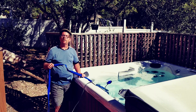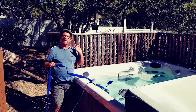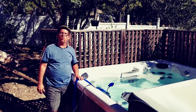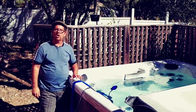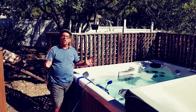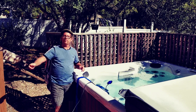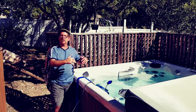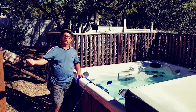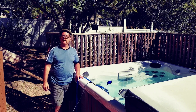Right now it's about 11 a.m., and if I want to soak in my hot tub tonight, using this pump to drain it quickly is crucial with the number of hours in the day. To summarize: don't drain your hot tub in your neighbor's yard, don't drain it at flower beds or tree roots, don't drain it near the foundation of your house. Drain it in the most inconspicuous spot in your yard, and if you need to, move it around so all 600 gallons isn't draining in one spot. And don't just dump it at the sewer drain at the curb — that feeds directly into nearby ponds, springs, and lakes.